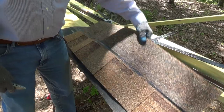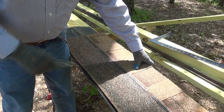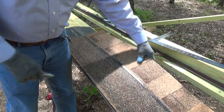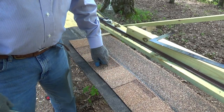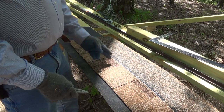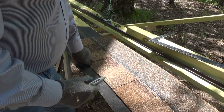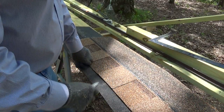The other style they used to have was jet shingles, which was essentially all one piece with no cut outs at all. They didn't last very long. Part of the problem was there was no allowance for shrinkage and expansion, and when they expanded they tended to buckle a lot. The other common style is called a three tab, which a lot of you have seen. You have a slot here and another slot down here. What happens is after a while, where those slots are, the water runs in and wears out the shingles — it disturbs the granular coating on them. So the rest of the shingle may not be too bad, but because it wears out in the slot, you end up having to replace your shingles.